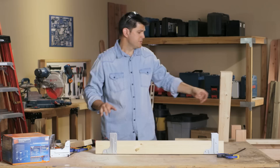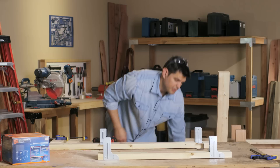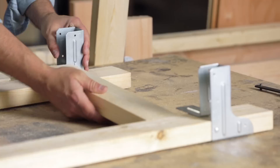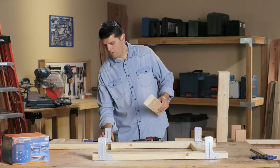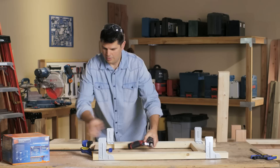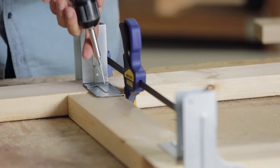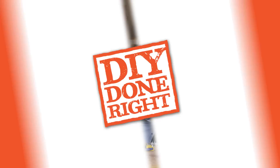With the connectors firmly attached to our front post, we need to go ahead and make the back post. We're gonna do this in sections — one side first, then put the connectors on the other side and join the two together. We'll lay these out and pull up the side rails we cut earlier and slide them into the connectors on both sides. Once the bottom connectors are screwed in nice and tight, we fit the rear post connector into the front post connector, clamp it, make sure it's snug, and drive in the connector screws — which are self-piloting and go in like butter. Then we repeat this for the other side and put the side rails on.